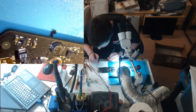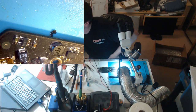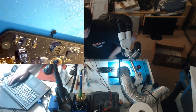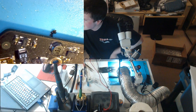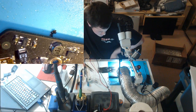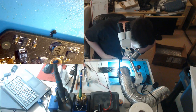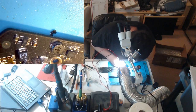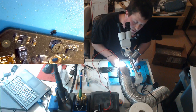Now let's measure on PP Bus G3 hot and see if we have PP Bus G3 hot. Search PP Bus G3 hot, and that's going to show up near the LVDS connector on F9700, so on the backlight fuse. That's going to be right here, and we get 0 volts.